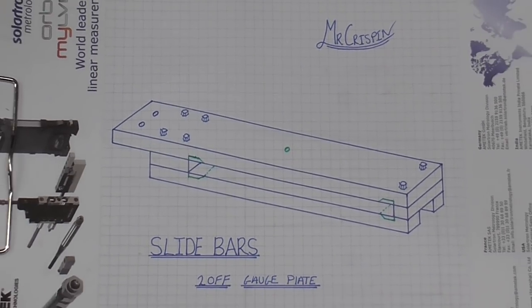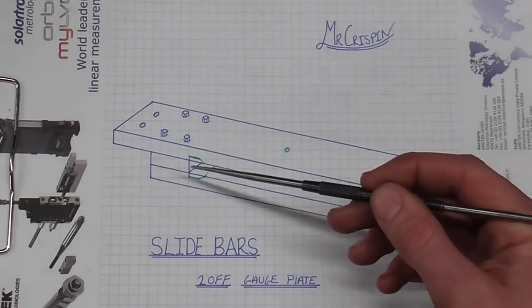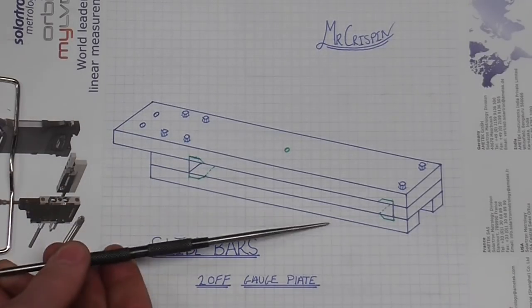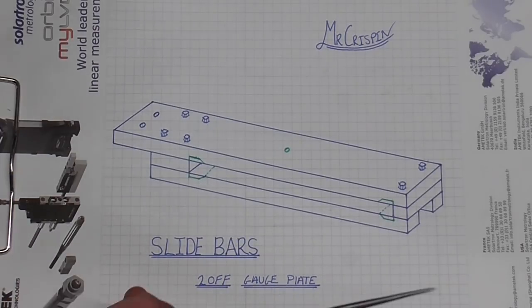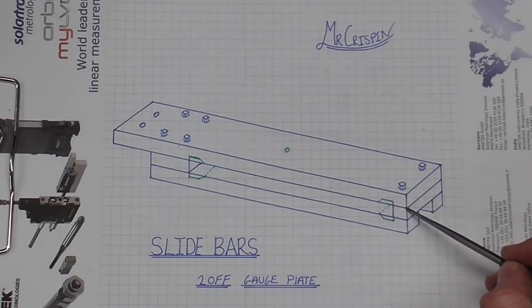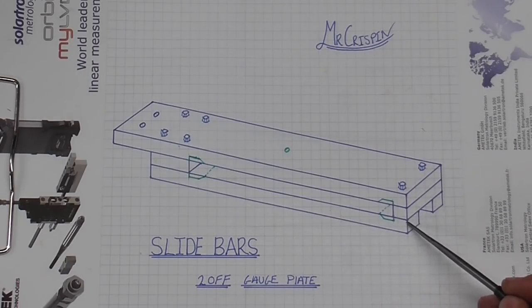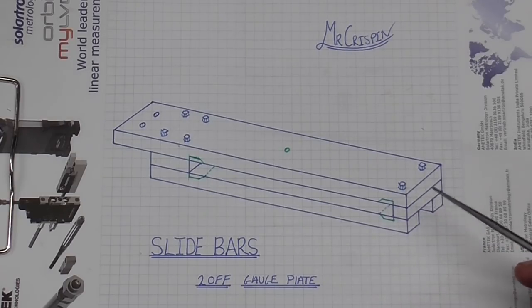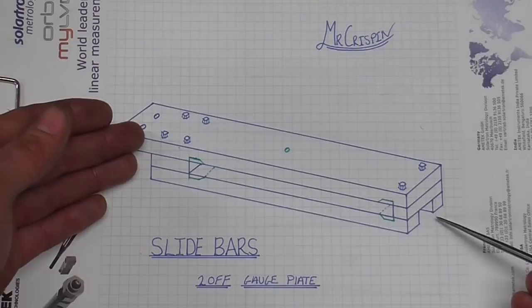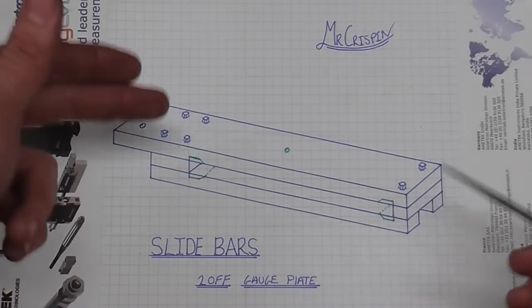This is what I call a plate assembly. You have one, two, three, four, and potentially five pieces stacked on top of each other and bolted together. A typical approach is to split it into component bits, manufacture each piece individually, and bolt them all together at the end. That's quite an effective technique if you are trying to mass produce these - you can batch the components up and make 25 of each. Also if you could get the material in the required cross section, all you would have to do is cut the ends and put the holes in.